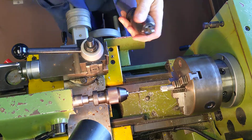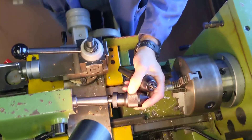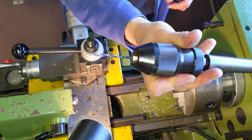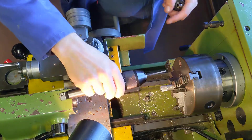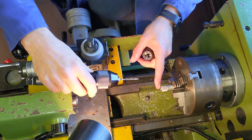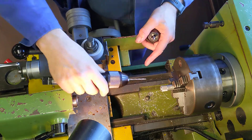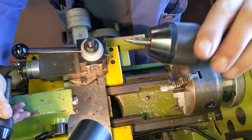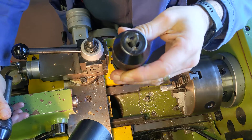The actual hole I want to drill is 3.3mm diameter — that's a standard 3.3mm drill bit. The problem with that one is if I try to start drilling with it, it's got a bit too much flex. As it bends it's not going to find center; it'll probably snap or give me an inaccurate hole. So I'm going to start off with a center drill instead.